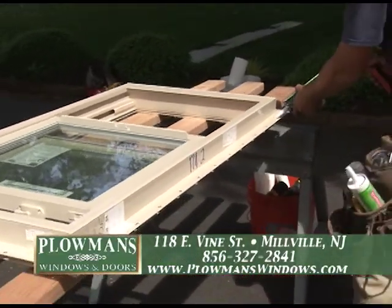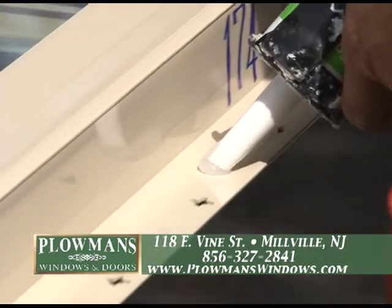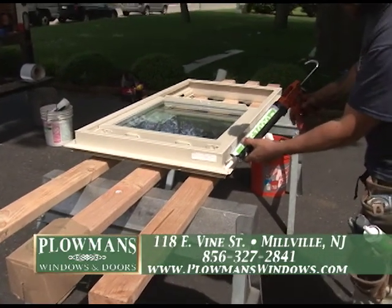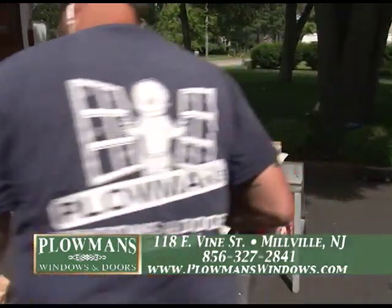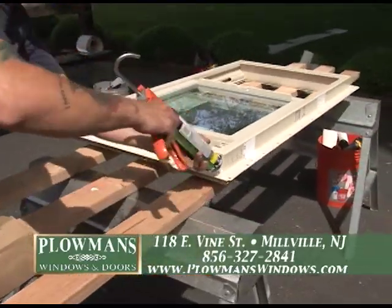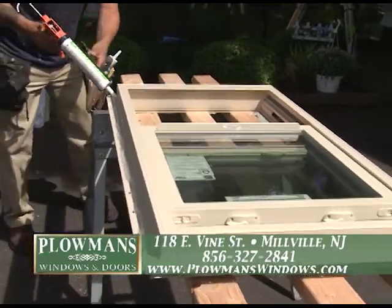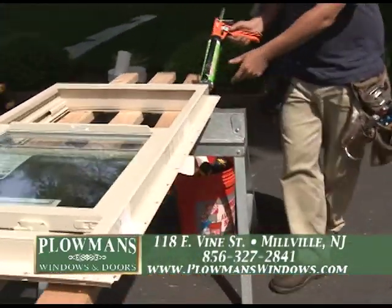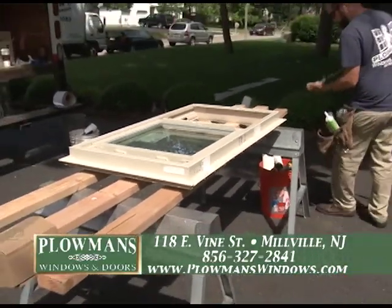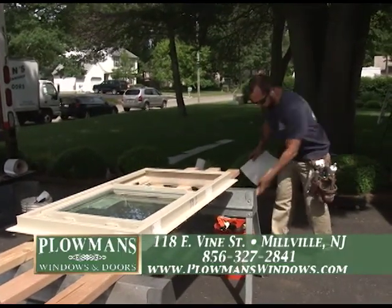Now he's applying silicone around the nail flange of this window — he goes completely around the window. This is a factory fused nail fin, not an applied nail fin. He's also going to do an inner seal, which helps with the insulation. That's pure clear silicone. The cost of a tube of that versus caulk is different — a lot of guys won't use the silicone; they'll use a caulk. Now he's taking care of the inner part of the frame. This is for where the window makes contact to that strip of insulation. He's only got a few minutes once this process is done to get this window into the opening. Once this is done and the window is fastened into the home, if you were later to try to take this out, it gives you a fight.